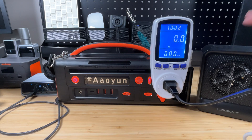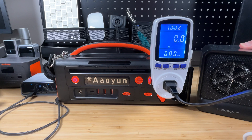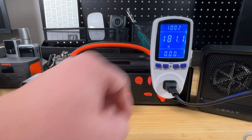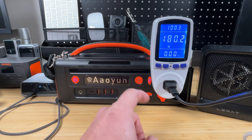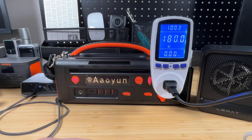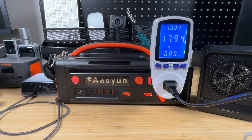Still testing the AC circuit. I've got a little space heater here with two settings — the low setting is definitely under 300 watts, but the high setting is usually above that, so I'm only going to test the low setting. Switching it on, we are now pulling 181 watts. If I plugged this same space heater into the wall, it would pull probably about 230 watts. So it's pulling a little bit less power, which is probably just a matter of the inverter — likely a modified sine wave versus a pure sine wave — but it's definitely working and putting out heat.